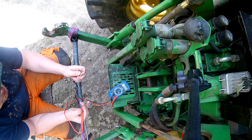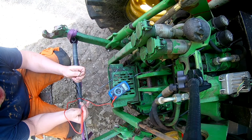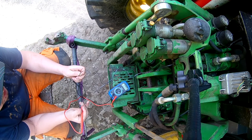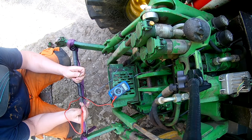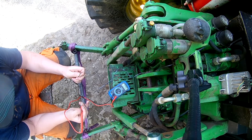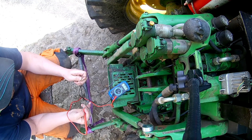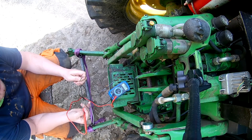We have had issues with the three-point hitch at the back of the John Deere 6010 tractor for the last few years. We had trouble a while back where the stepper — it's a plastic thing on top — the control motor for it had taken in water, so that was replaced. You can see it here; it's the shiny part, the rest is green.